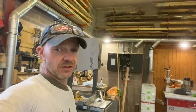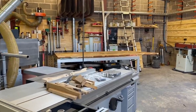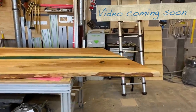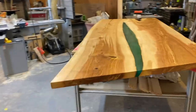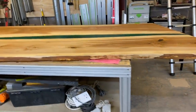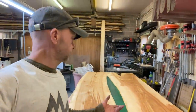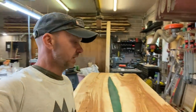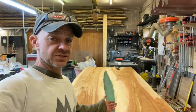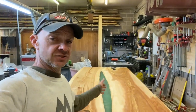It's still a bit of a bomb site — I've been working so hard on the building outside. Both sides of the slab are oiled, by the way — no different to a table even though it's going under a unit — I oil the whole thing to avoid any cupping. Really lovely and flat. I've got a cunning plan: I'm going to place this absolutely massive slab on a couple of different sets of legs. I've had so many clients at shows asking for pictures of big tables that can seat 12, so I'm going to make it into a table before I cut the sink out and take some pictures.